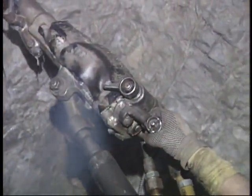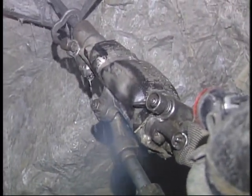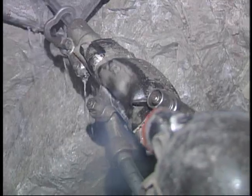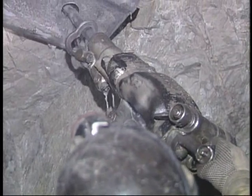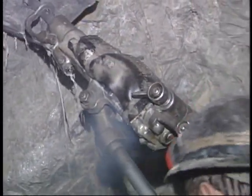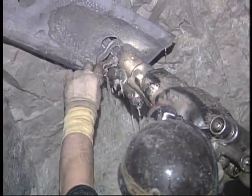You want just a little pull on that mat since you're only putting 2 bolts in it. So you put it where it'll just pull that mat and make it pull real tight. If you put just a little angle on that last bolt, just a little, not much, it'll pull that mat real tight, and it really holds the ground good for the full 6 foot. If you set up too far away and you drill in, then you're going to collapse your mat, and your mat's useless. So then you either take your driver, your split set driver, or your pipe wrench.